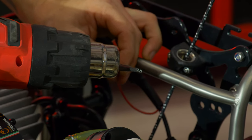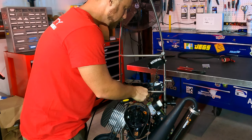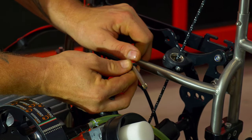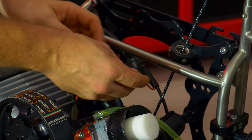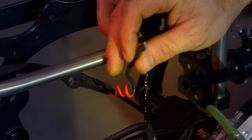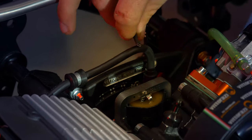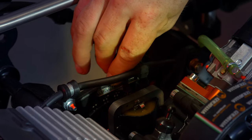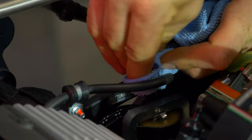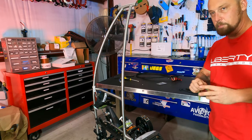Now you've got another piece of heat shrink in there — a little bit larger diameter. Put this over the whole terminal itself so you don't want this wire shorting out inadvertently — just insulating it that much more. An additional thing I do with my installs is make a little pigtail — just a couple of loops that induce a little bit of slack into that spark plug wire. You don't want tension on the spark plug wire because it'll pull apart and cause issues. The terminals that off-grid includes fit very snugly on the male spade. Use a rag to give yourself extra traction on your fingers and pop that on there.